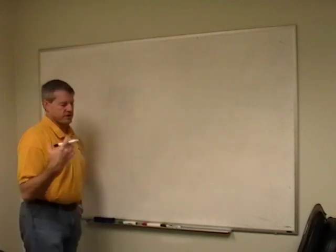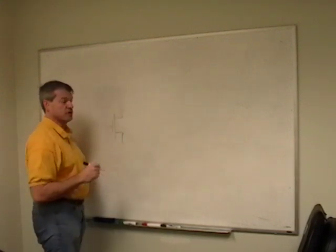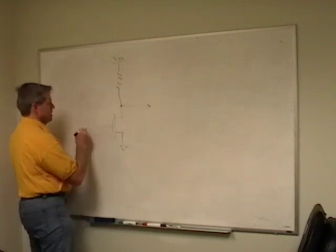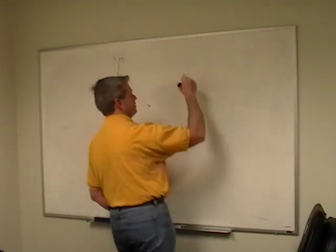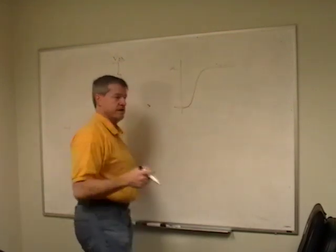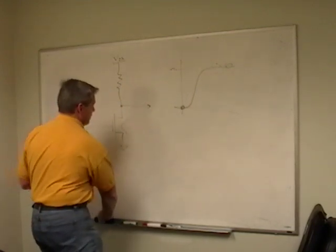So mostly what you hear about MOS, you hear about CMOS, complementary MOS, is for logic. So we started out with just NMOS, or maybe it was PMOS, I don't remember. You tie it up to a resistor, you tie your output here, VDD, ground. And if I put a high signal in here, this conducts, right? This guy turns on. And what we're going to assume is that we're running our voltage curves. So ground is down here, and our VT is here. So we're always in saturation in a digital process. We're using this thing as a switch. It's on or it's off. We're either way down here where there's nanoamps of current, or we're way up here where we're giving all the current we can give. And so we're really overdriving these things hard when we do this.